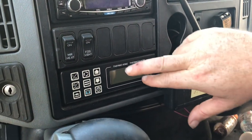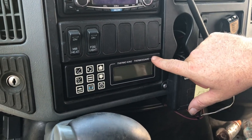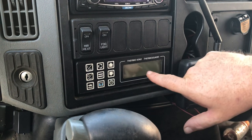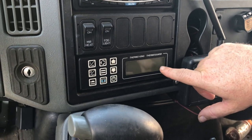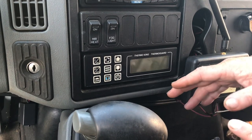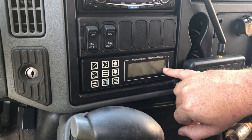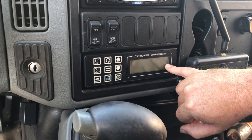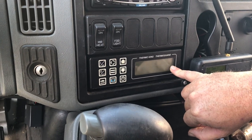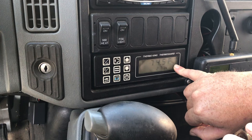I'm going to show you how to clear out the alarm code on this type of thermal guard unit. When you come in and you see that the screen is blinking like this, it's thrown an alarm. You'll also see over here there's a triangle with an exclamation mark in it — that means there's at least one error code in here, and it will not start with that in.